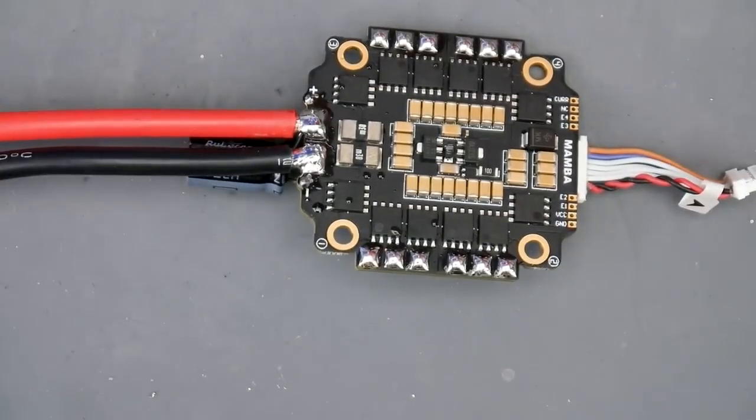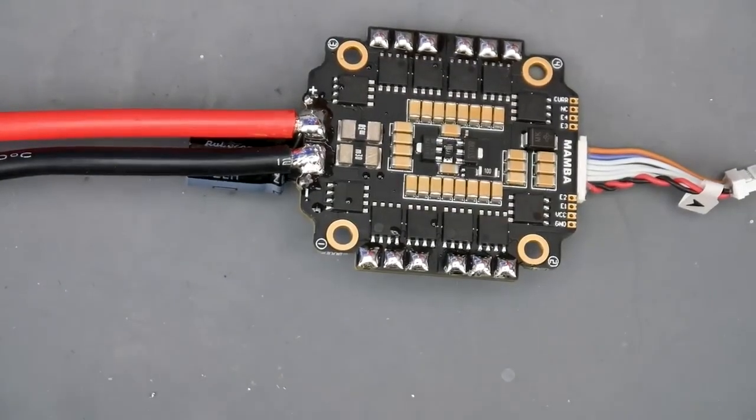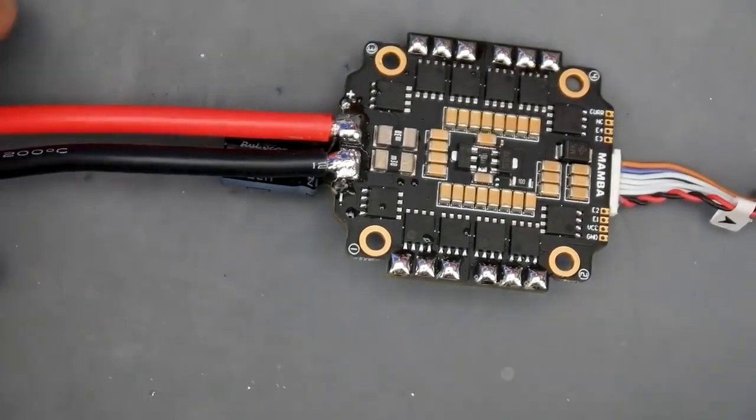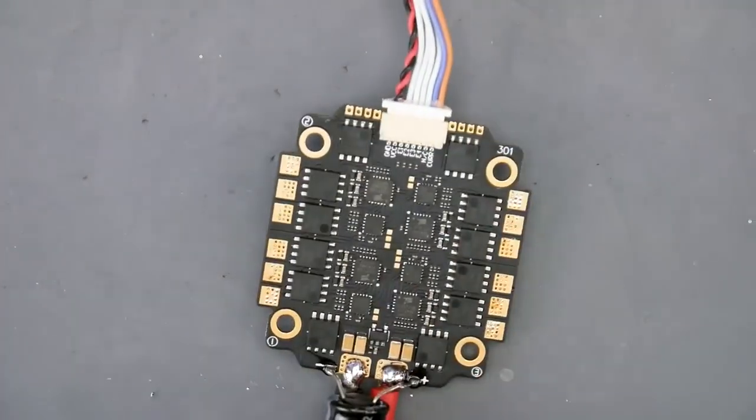So always increase the temperature, and once you do that, you will have a really ugly tip, so lower the temperature back down to 350 degrees Celsius. That's if you are using leaded solder like I am, and most people do. Actually, I like to stick at 360 and just keep adding solder on the tip, because you don't want to ruin the tip. But you can always buy new tips for your soldering iron. There we go. All right, so now we're basically ready. All we need to do is start connecting up the motors to this.